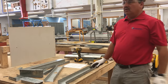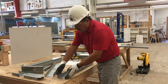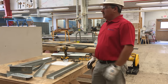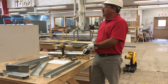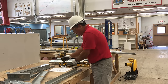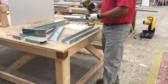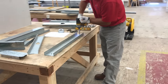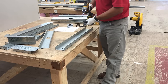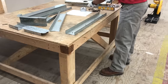I'm going to start our framing process now. We have a piece of track, and normally you would see two lines snapped on the bottom of the floor with a chalk line. But in this case, I'm going to secure it right to the table we're using here — same fastener, screwed down with our cordless. Do the ends first, then go in the middle and put a couple there. I'll use a couple slightly longer screws just to secure it so it doesn't fall during framing.